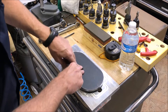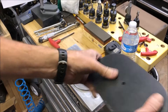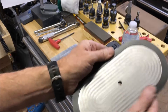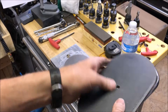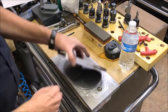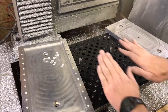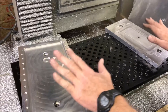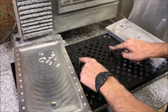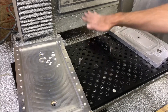Basically that will just screw down there. It turned out pretty good. This is hot rolled. There is really no reason to clean this up because it is just a tool. Thanks for the idea Adam, in case you happen to be watching. Oh by the way, I didn't have to set zeros on any of this. This is all done off of these two locating pins on the SMW Saunders Machine Works tooling plate.